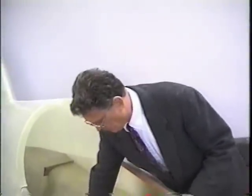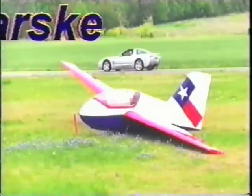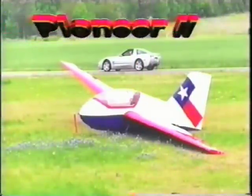To do a center of gravity balance check, you can climb on the ship with the canopy on, and the aircraft should just balance on the main gear. If it tends to fall heavily to the nose, it's a little nose-heavy — you can still fly it, but it won't be as comfortable. But if the ship falls back on its tail and stays there, it might be wise to add a little weight up into the nose of the glider — two or three pounds of lead.